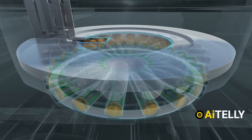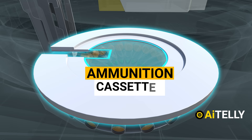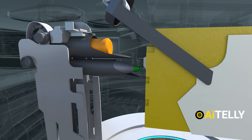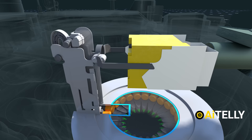Starting from the base, this is the carousel. Above the carousel is the projectile or tank shell. Close to it is the propellant, which is required to fire the tank — just like the British Challenger tank requires a projectile and a propellant to complete the whole process of firing. Above it are the ammunition cassettes, which serve as the base for both the gunner and commander. This is the cassette hoist — when ordered, it rotates and stops at the desired tank shell, then elevates to the suitable height. Moving ahead is the stub ejector. Once all is set, the gunner presses the trigger and fires the gun, which then ejects the empty shell as shown in the animation.